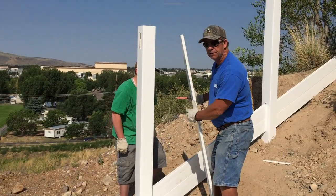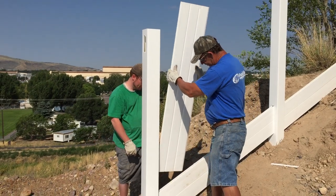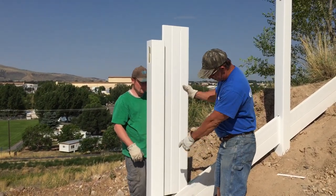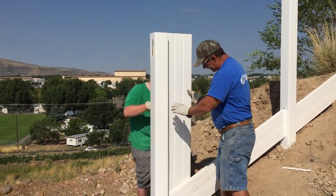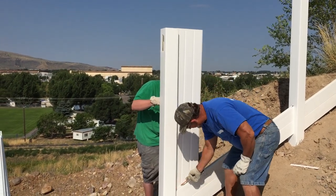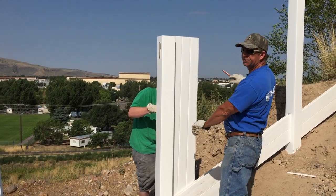We're back at this steep angle again. We've got to make this picket match that angle — if I put it in it won't work, see the gap at the bottom? So you've got to cut the picket. Put it right down beside it, hold it there, then mark with a pencil. That gets your angle on the bottom as it goes uphill, and they'll all be just like that.